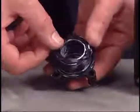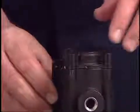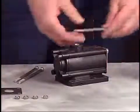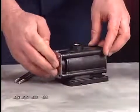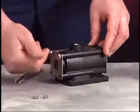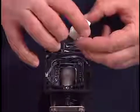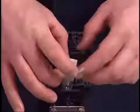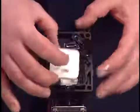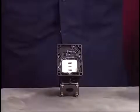Place a new gasket on the end cap. Secure the end cap to the valve block using the end plates, screws, and nuts. Use a 10-millimeter wrench to tighten the nuts — torque to 35 to 40 inch-pounds, or 4 to 4.5 newton-meters. Lubricate the ceramic valve insert and install it into the valve block, making sure the concave of the insert faces out and the radius of the concave is parallel to the spool. Now lubricate and install the ceramic valve plate over the insert — make sure the plate lies flat with the polished side facing the insert.